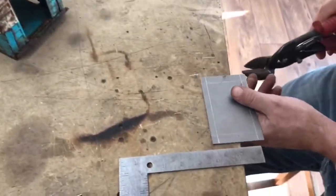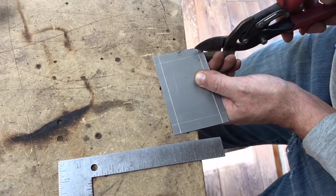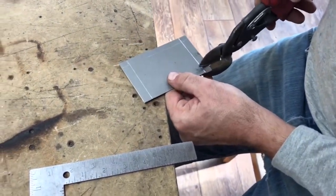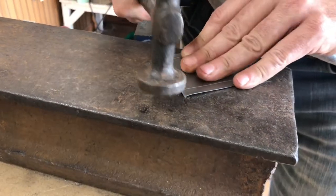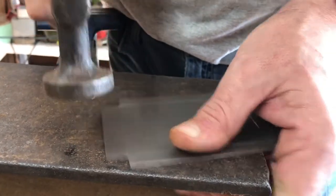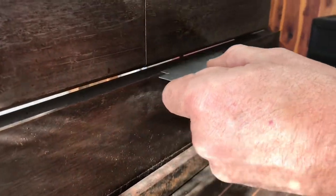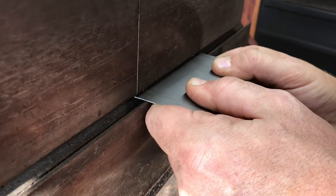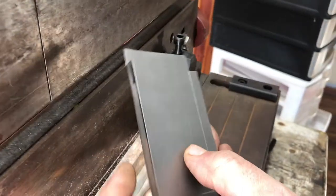What I'm gonna do now is cut your corners out. The problem with making a bunch of lines is it's hard to remember which one's the right one. I'm gonna hammer this back down flat — it's all gotta be nice and flat. Now we're gonna come over to the brake and bend up on that. I'm gonna get it down here as far as I can and bump it up. That deep scratch I was telling you about, you're gonna find it and it's gonna clip right into it — you'll hear it and you'll feel it. Pull the handle. Got a nice, perfect bend.